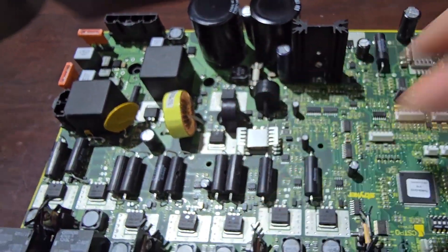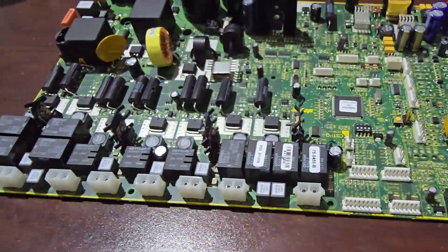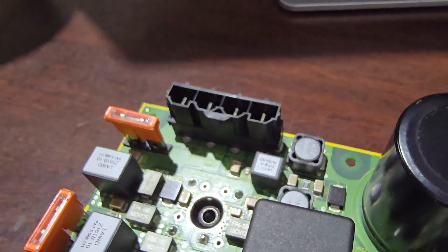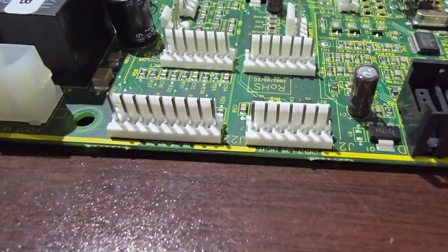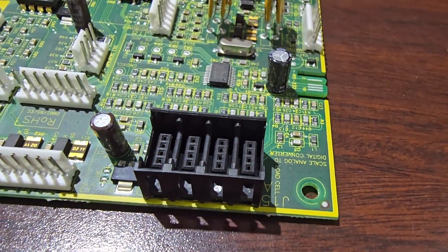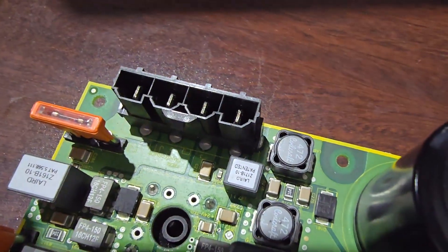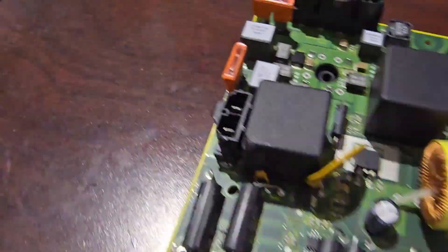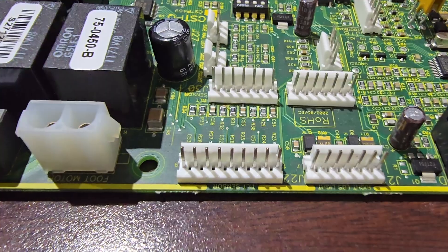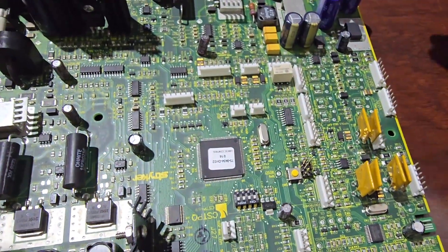There are some current measurements because this is a medical grade power supply — it would know if one of your motors is pulling too much. Notice how we've got large connectors, medium connectors, small connectors, and tiny connectors. The gauge — the size of the conductors — goes from the largest, which handles the most current, to moderate ones for each of the motors, to large ones for the batteries, and small connectors. These smaller ones here are mainly signaling ports. You can see this here says it's a CAN bus controller, DC controller.